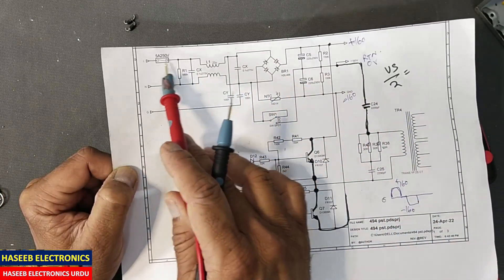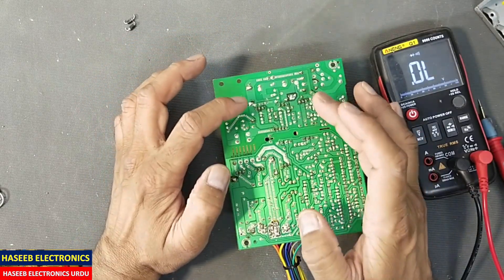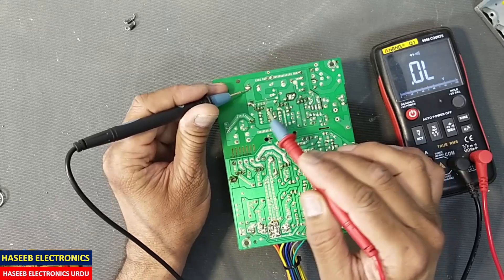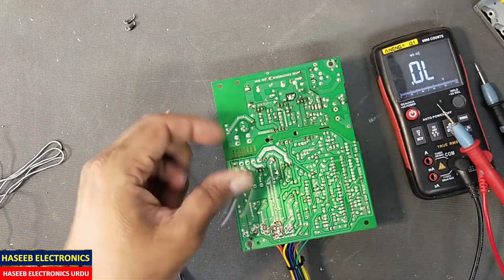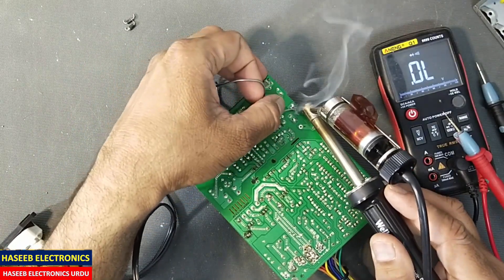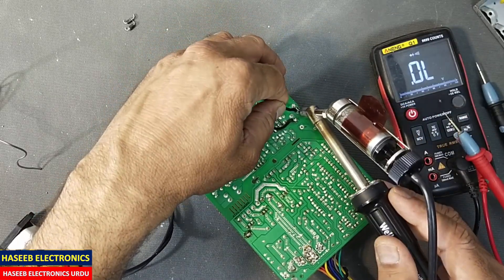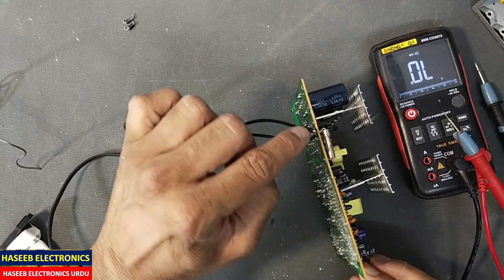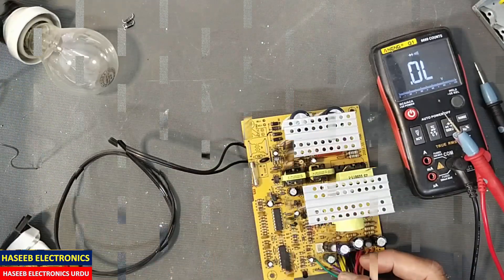So that was the reason the fuse burned out. Now we will check the voltage on the DC rail — this time we don't have any short circuit on the DC rail. If there is a short circuit and we find a beep, never apply power at that time; we will need to verify the power transistors. Now I will connect the line input to the input terminal, but this time I am not connecting the fuse first — we will verify that our circuit is working properly, then we will connect the fuse. I will connect a series lamp at the output side of the fuse so that if the lamp glows fully, there is a short circuit.